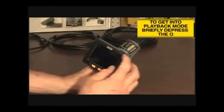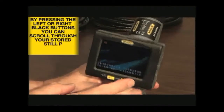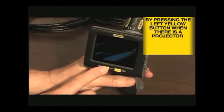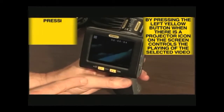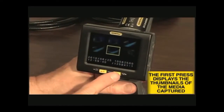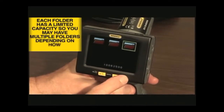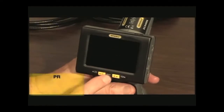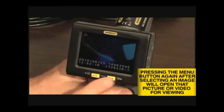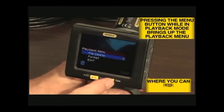Once you are in playback mode, after briefly pressing the on-off button on the top of the monitor, the controls have the following functions. Pressing the left or right outer black button scrolls you through your stored pictures and videos, one step in either direction in their order of capture. Pressing the left yellow button when a projector icon is on screen controls the playing of that particular video. Pressing the right yellow button controls the file menu of the pictures and videos: the first press displays thumbnails of the media captured so far, and pressing it again reveals the folder structure storing your pictures and video. Each folder handles only so much data, so there will be multiple folders depending on how many images you have stored. Pressing the menu button after selecting a folder will open that folder, and pressing it again after selecting an image will open that picture or video for viewing. Pressing the center menu button while in normal playback mode will open the playback menu where you can format and delete images.